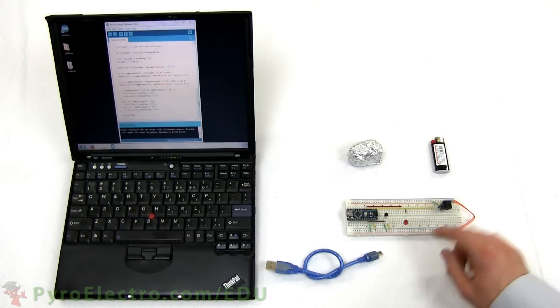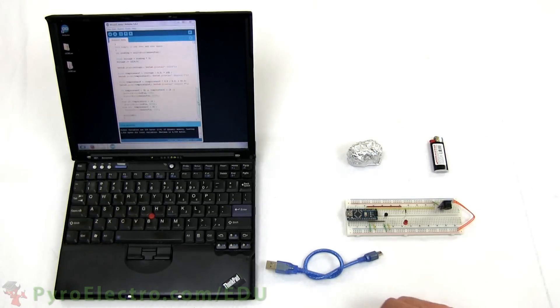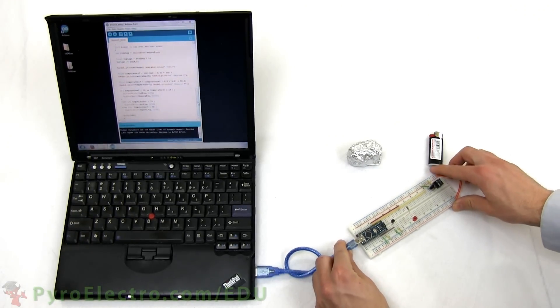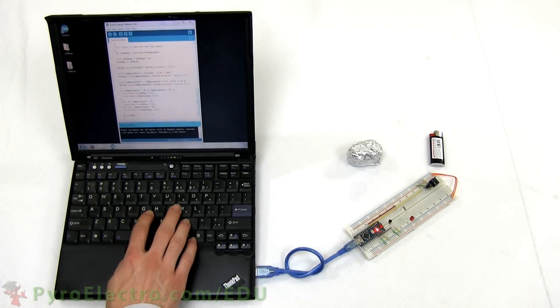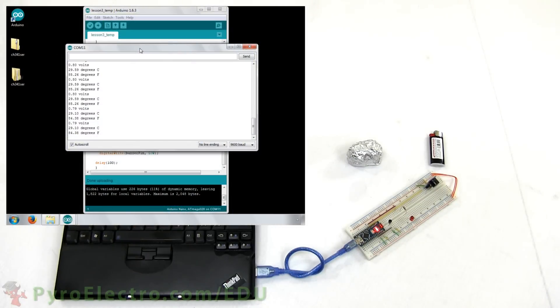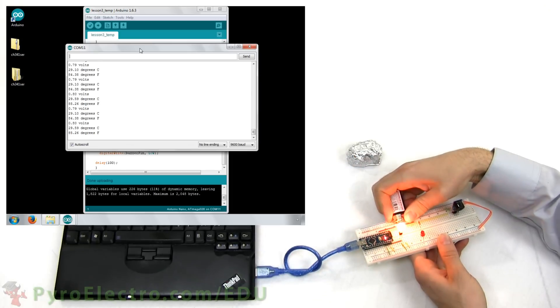Now our circuit is ready for testing. To test the temperature sensor, I have a lighter to make some heat, and an ice cube covered in aluminum foil. First let's connect the USB cable to power up our experiment, and then inside of the Arduino program under Tools, click Serial Monitor. This will bring up the serial output that our program continually sends to the laptop. So now let's use the lighter to put some heat on the temperature sensor. You can see it doesn't take long to get warm, and the buzzer goes off loudly. Now we'll take the ice cube and cool things back down. Remember, anything under 25 degrees Celsius will turn the LED on.